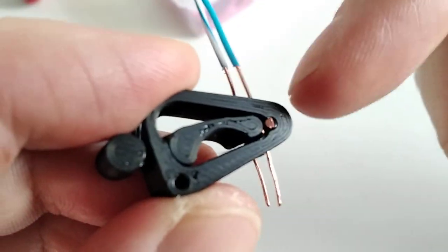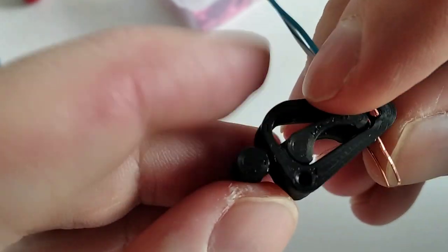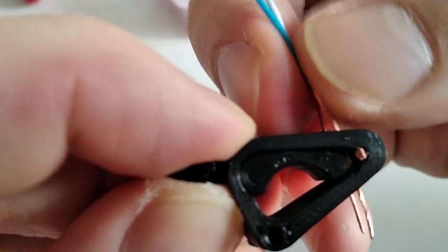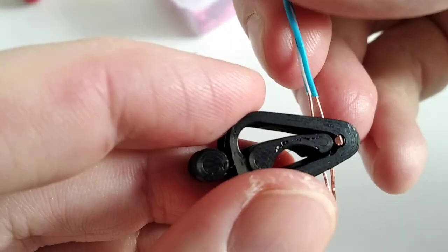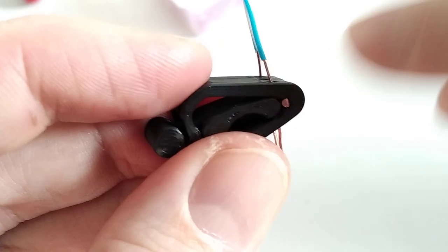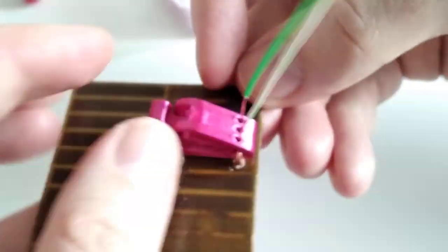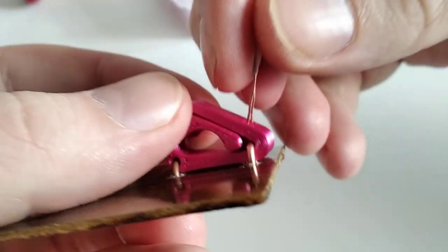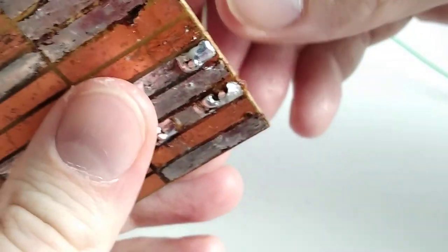The only thing you have to do is insert this little wire in here, which serves as a bus wire to connect all the wires in the clamp. There is a lever which allows you to open it, position the wires in and out, and then lock it. Another cool trick is that when you use a longer bus wire you can solder it right to the circuit board and use it like a terminal for your board — if you're prototyping something and need a terminal quickly, you can use it. It works the same way as in standalone manner: insert the wires, click, and you have a reliable connection directly to your PCB.